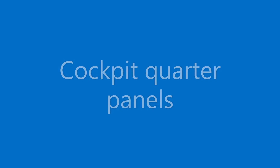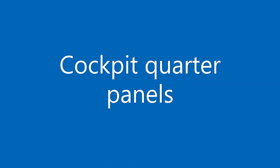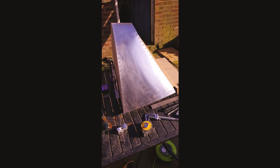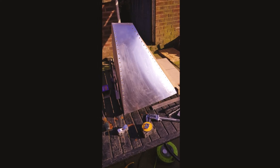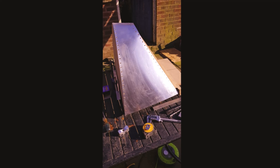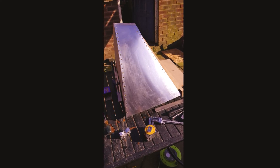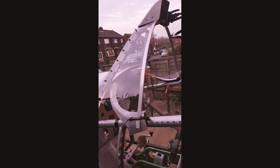The forward transparent quarter panels were manufactured from 3/16 inch thick polycarbonate, CNC machined to the correct shape. The panels were then heated to 150 degrees C and drape formed over a large former — in itself a full scale mock up of the forward section of the canopy structure.